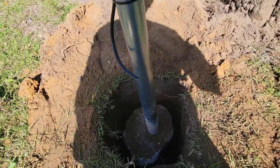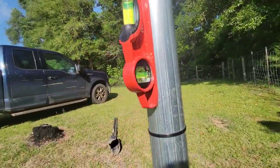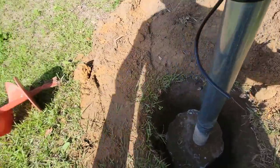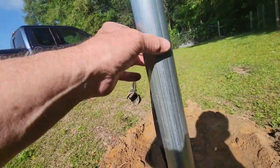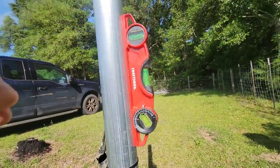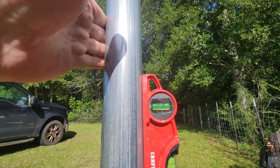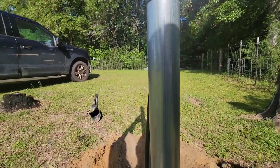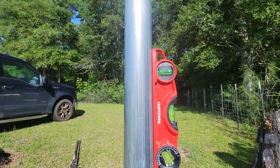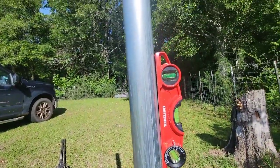It'll sink in at the bottom to make it stable. Put your level on there, get it pretty level on that side, do both sides, keep checking. Take a little dirt on both sides, take my hammer and pack it down, take my piece of wood and go in there packing it down as tight as I can, level it off some more. Get it pretty stable just like this here — level on this side, turn around on the other side. Knock it, push it back this way, get it level, take a little dirt and pack over here on this side to keep it level.